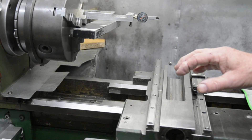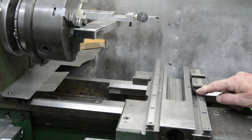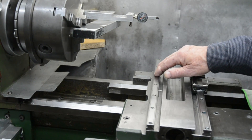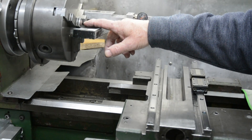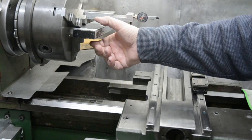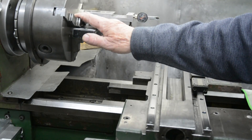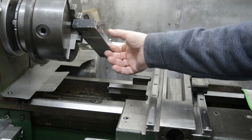The top of the saddle is back on the lathe with the linear rails bolted on. What remains is to align these true to the spin axes of the lathe itself. To do that I've got an indicator fairly rigidly bolted to two odd pieces of aluminium which is clamped in the chuck. It forms a very rigid mounting.